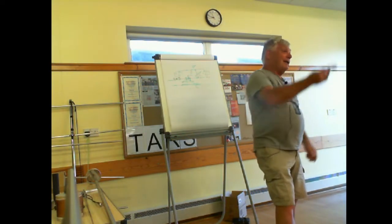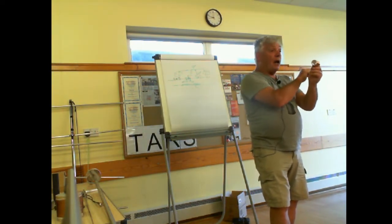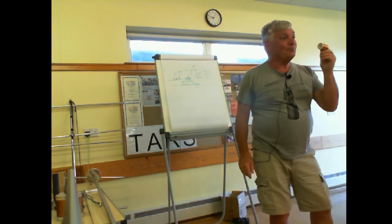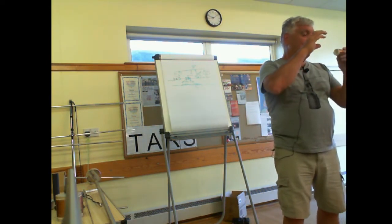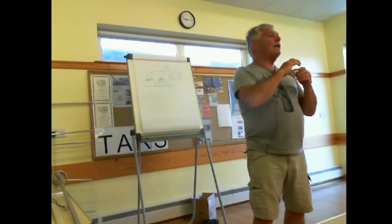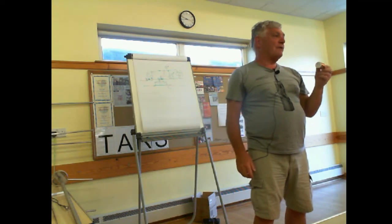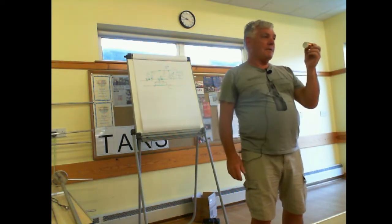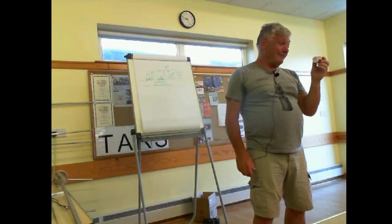Right. This is a coil that is sending an RF signal down it, and it is made of plastic and so on and so forth, and it's a coil and everything else, and the speed of light on this is not 300. It's roughly 0.75 of the speed of light. You've got to take that into account.